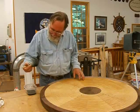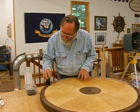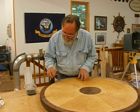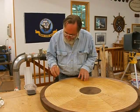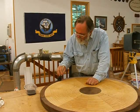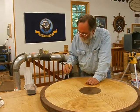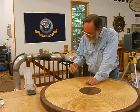Dyeing the wood is kind of a meticulous operation. I use a foam applicator and you have to just get right up to the edge. You don't want to dye the maple — just the walnut with this walnut mix. It's an aniline dye mixture of some extra-dark blackly deep mission brown with a little touch of yellow in it. It's just the right color.